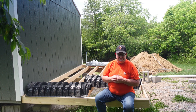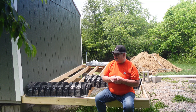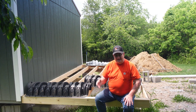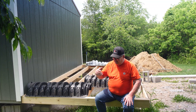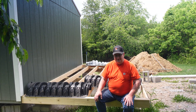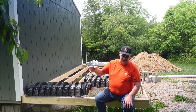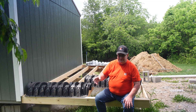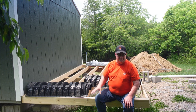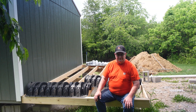As long as you don't load it up with stuff like that, you should be able to go five or six years without even thinking about getting it pumped — because it's just the two of us. We're not going to go through 240 gallons of water a day. That's the basics of how to use a gravity-fed sewage treatment system — your septic. I don't have to worry about aerator chambers, power to pumps, or any of that kind of stuff, because mine's gravity-fed. And it's the cheapest one you can get. Thank goodness we qualified for that.